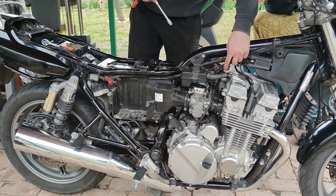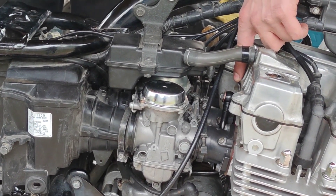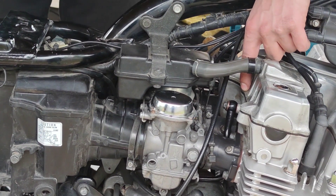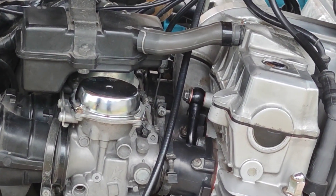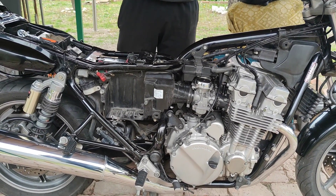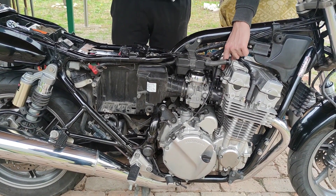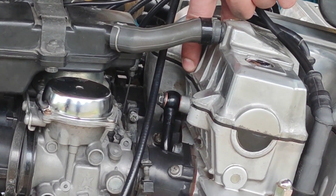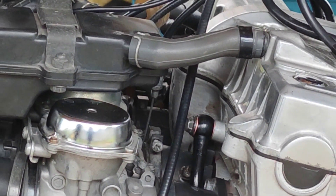The copper sealings we tried to put on the pipes didn't work well because copper is harder than aluminum. The blacksmith will take these washers, burn them, and then insert them into cold water — this way the copper gets softer. I don't really recommend this; normally I'd use an aluminum washer. But we'll try it today. The reason soft washers work here is because the tightening force is only 13 Newton meters — small enough that aluminum deforms sufficiently to seal without leakage.